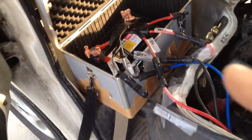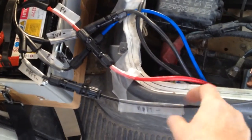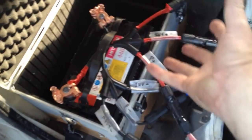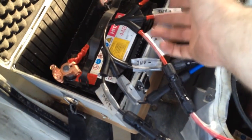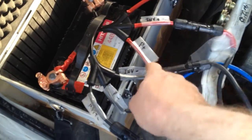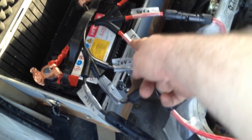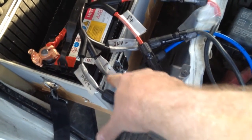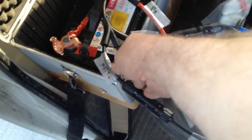Here is the secondary battery hooked up and I've actually labeled stuff here — something I really recommend doing. Go ahead and take the time to cover your terminals and label things if you're new. This is my inverter positive, this is my parallel positive, my inverter negative, my parallel connection negative, and my MPPT.